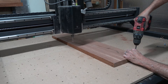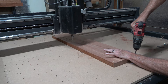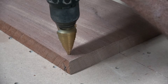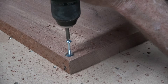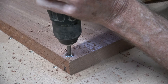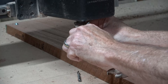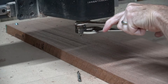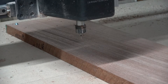Since my start position is down in the lower left corner of the workpiece, one thing I noticed is that because these screws sit proud of the surface, I had to countersink the hole so that I could screw that particular screw down below the surface — that way the bit isn't going to hit it as it moves from the start position to where it begins the carve. All of the carving operations on this side will be for the outside of the body halves, and the first operation involves cutting the F-hole, so I swap out the quarter-inch bit for a sixteenth-inch diameter two-flute spiral up-cut bit.